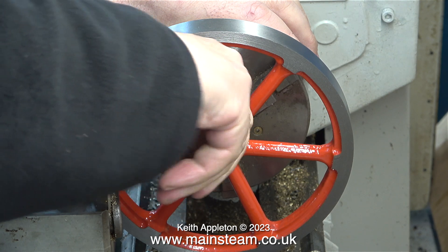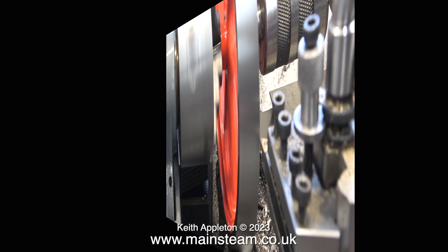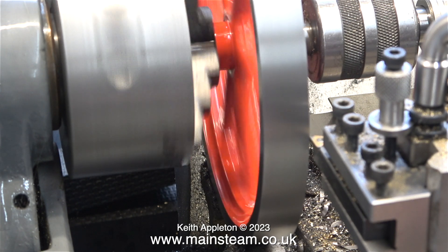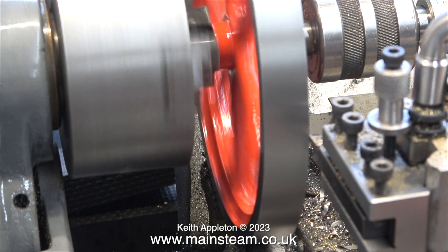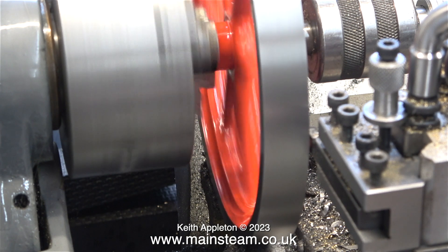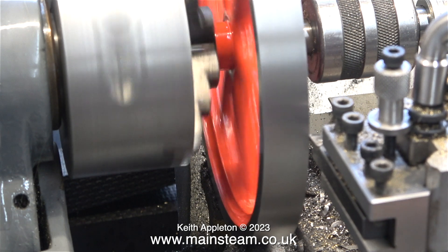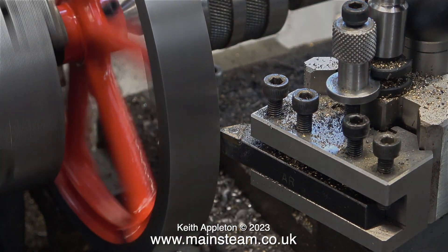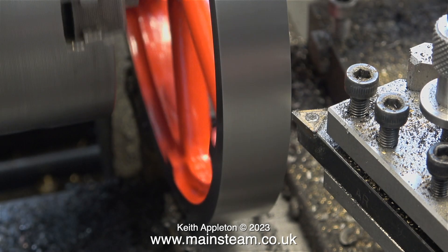In this clip I'm just checking that the grub screw is tight, because the resonant frequency is notorious for vibrating fixings loose. Also, I've changed lathes — I've fitted the mandrel into the chuck of my Myford ML7R lathe, and now the chatter has got much worse. The real problem is the lathe tool tip: it's okay for general work but not good enough for this job. And now it's new tip time.